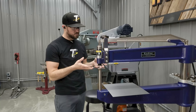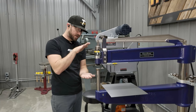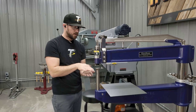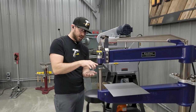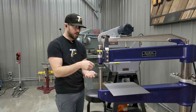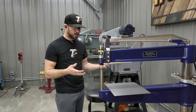Another reason you always want to keep the dies in contact while hammering and not bouncing around is because of that retaining clip — if you don't have enough pressure and the die starts slapping around in here, it will actually break that retaining clip and you have to replace it. Not a big deal, but it can happen.